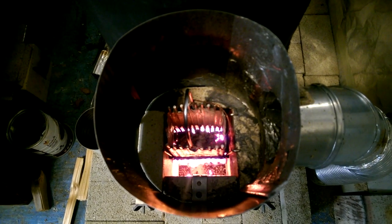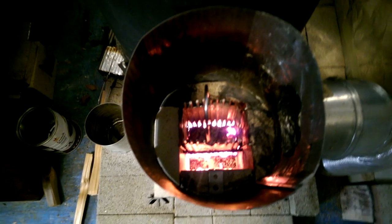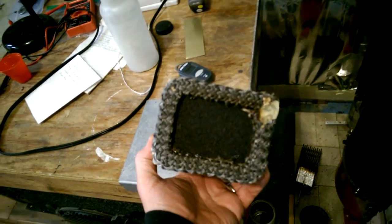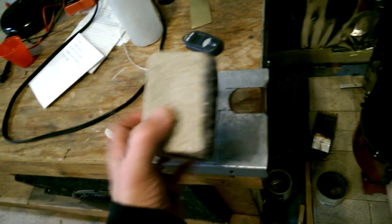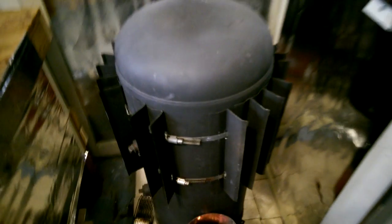That air gap allows adjustment of the air-fuel ratio mixture just by positioning the fire basket front to rear in the opening of the firebox. There it goes again. These will burn out — I'll shake the rest of the embers into the bottom, pull the basket out, and then seal it off. This is just a piece of brick that I've got some fireplace rope glued to, and I just put this down on top of the opening to shut the stove off.